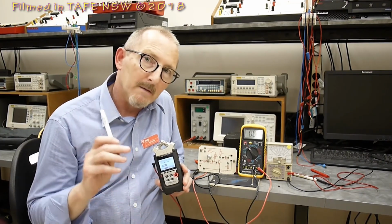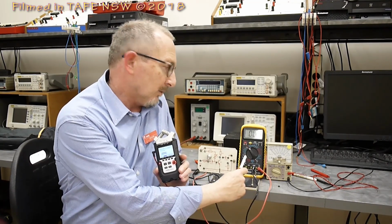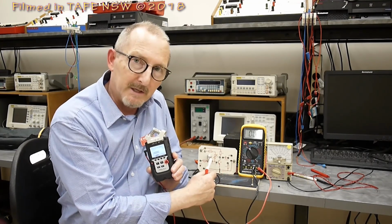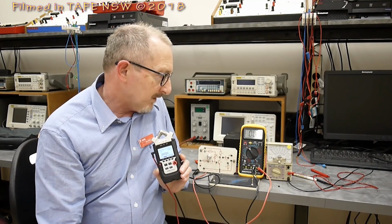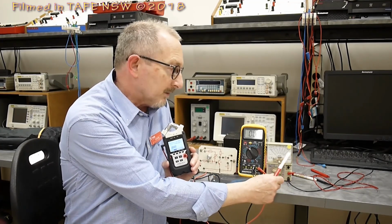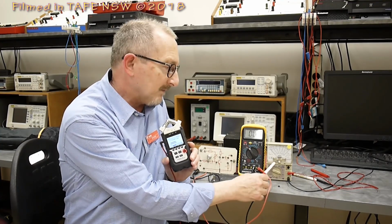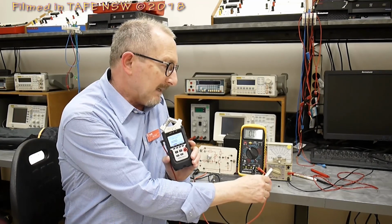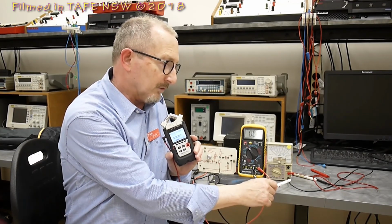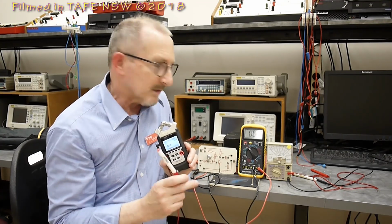So that's about it for measuring the transistors using both the analog multimeter and the digital multimeter, and working with the very first board that we'll be using in the Amplifier Fundamentals subject here at TAFE New South Wales. Don't forget to look at the circuit again and understand about the full scale deflection on the meter, and the fact that we need current to drive the meter movement, therefore we have to have the internal battery. But that internal battery current of course flows out through the leads, and the lead polarity is actually different to the colour, only in the ohms range, only when we're measuring diodes and when we're measuring transistors.